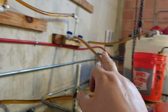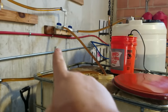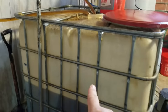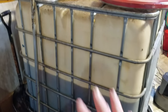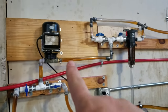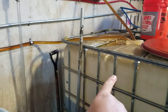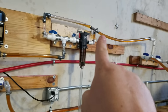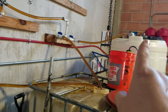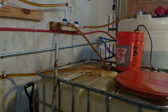And then you can either take it directly to the biodiesel producer, or you can take it right to the 375 gallon tote of oil. Now, the great thing is once the oil is in here, we can hit the same pump, just flip the switch, and it actually sucks it out of the barrel, and then it goes around the filter, and it goes directly into the biodiesel producer. So once it's filtered, we never have to touch it. Quick and easy.